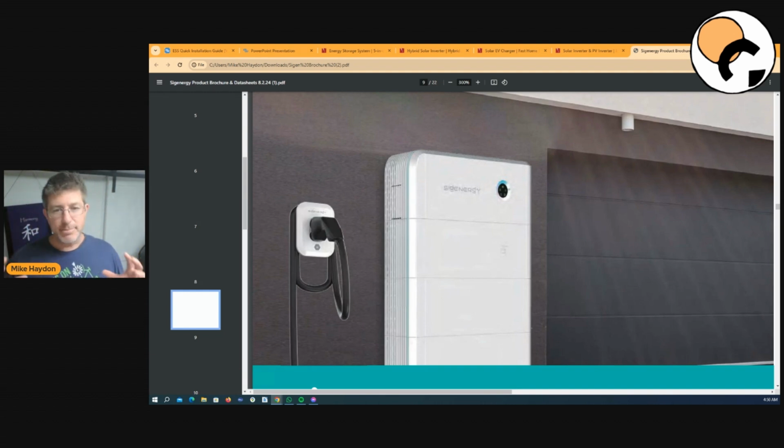And I think it's all built around these PCSs, the power conversion system, which is like an optimizer for your battery, if you think about it like that. So every single battery has its own optimizer. It's DC, so it's more of an optimizer than a micro inverter inside the battery. So with these single phase car chargers, you've got a 12 kilowatt DC charger, which is great.